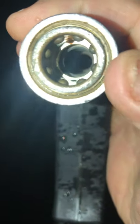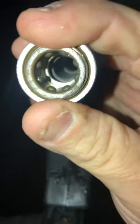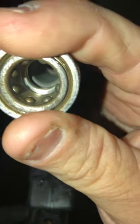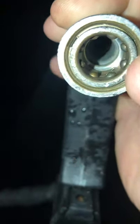Let's look at this attachment. This is obviously our surface cleaner here. This thing is gone. It got ate up. It blew out, whatever the case was. Now, if there's an old O-ring in there, you take a dental pick and dig it out or whatever you got. Let's let the mosquito guy pass by. So anyway, just dig it out of there. Sometimes flush it out, whatever. But to put it in, you just use a dental pick or a truck key.